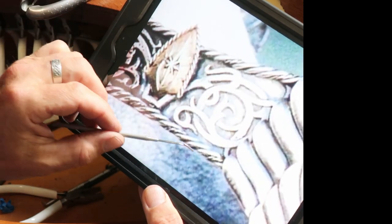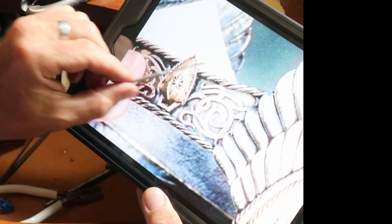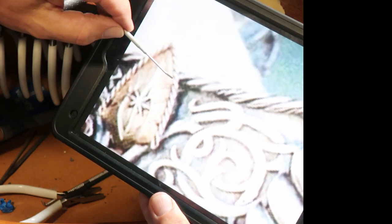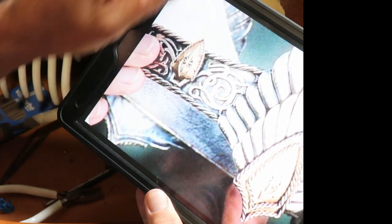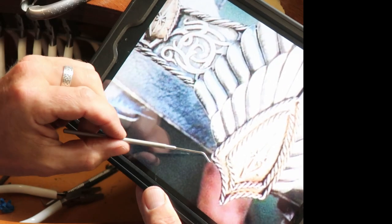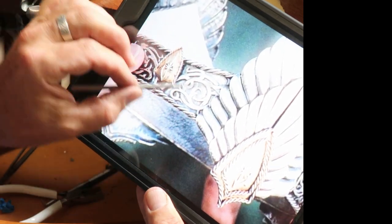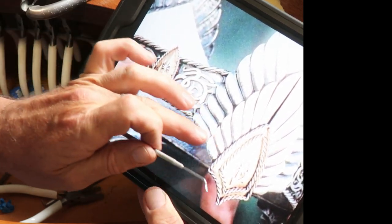When it comes to the wire, we've got twisted wire here. We've got a larger gauge twisted wire for the main part, but what is often missed is that there's a finer gauge twisted wire wound around in between the larger gauge wire. Once again, that just gives some extra detail. This twisted wire is a medium gauge. The details were pierced out and soldered on. Everything — there's very little in there that's flat. The main body of the crown is flat, but everything laid on it is either domed or textured, or both in a lot of cases.